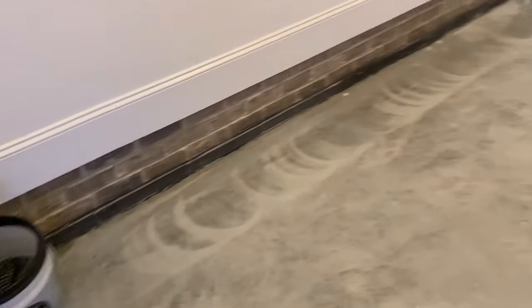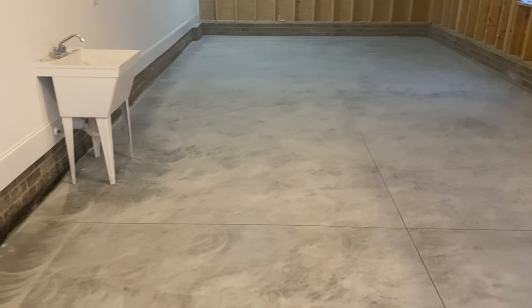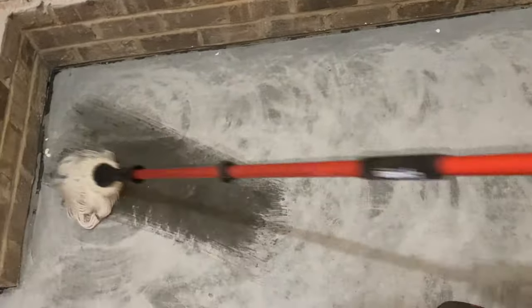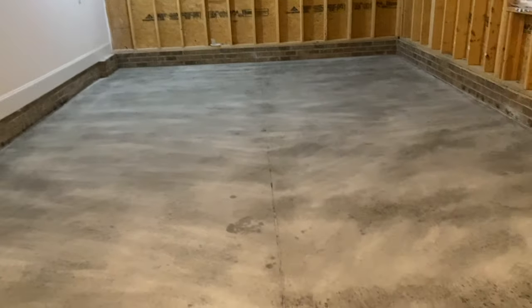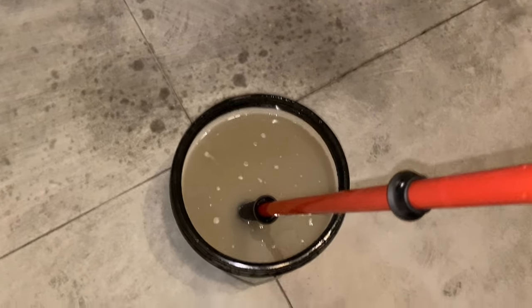Last step — good old-fashioned mop and some water. I'm going to use a little bit of water and mop up all the dust on the floor. I'm going to wring this out every 50 square feet or so. You can see it's picking up a lot of dust. I'm damp mopping — I'm about two-thirds of the way done. This area is not mopped; this area is mopped. That's why I'm damp mopping, because this has to be dry in the morning so I can put the coat on. I've already changed the water three times.